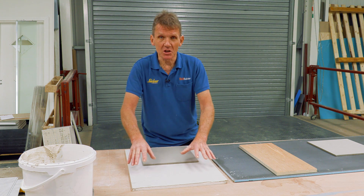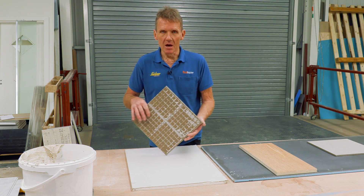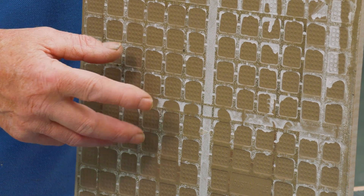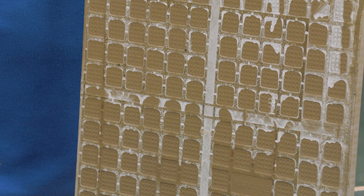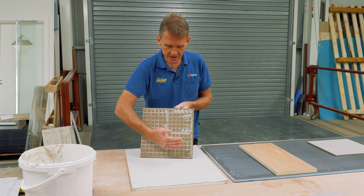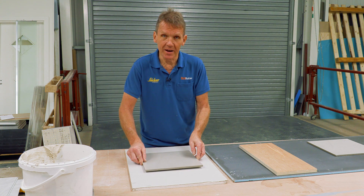The plasterboard will take 20 kilos. We've got a tile here which is a 10 millimeter porcelain tile, coming out at about 18 kilos per square meter. If you do the maths on that, you can see that you haven't got that margin. So you need to make sure that it's continuously bedded with a notch trowel and pressed down firmly.